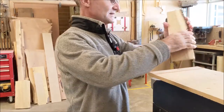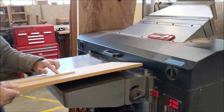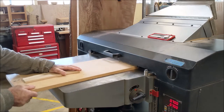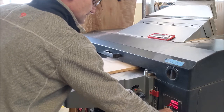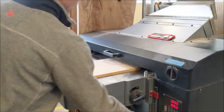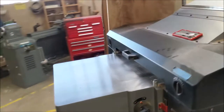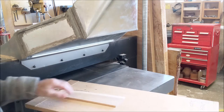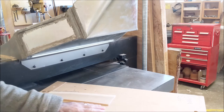We'll tape it on here. Here's my Laguna planer — this piece is 0.35 thick, my sled is 0.75, so 0.35 plus 0.75 is 1.1. We'll program 1.05, arrow down, start. You can see how nice it holds on there — even on that really torn-up top surface it held on there great.